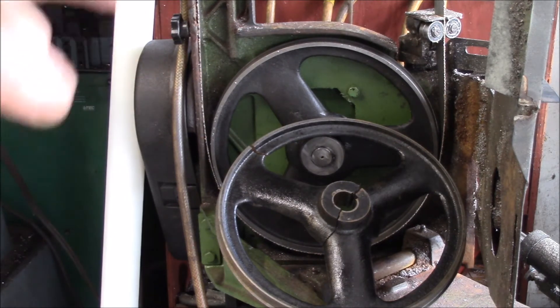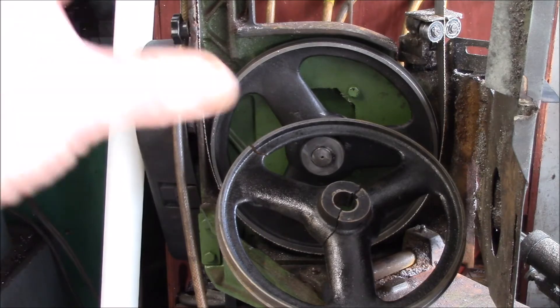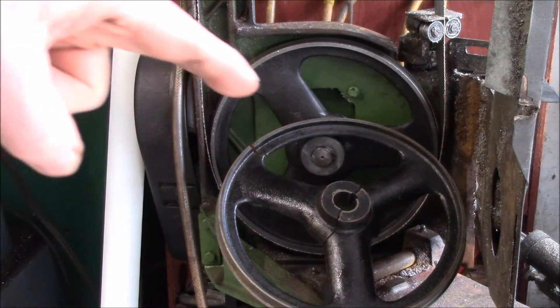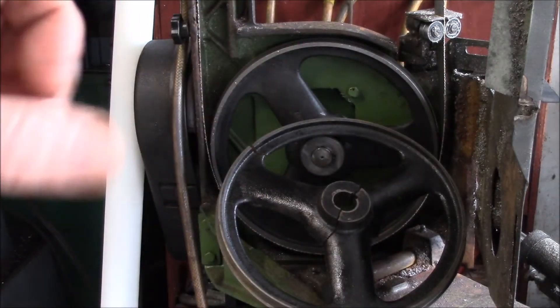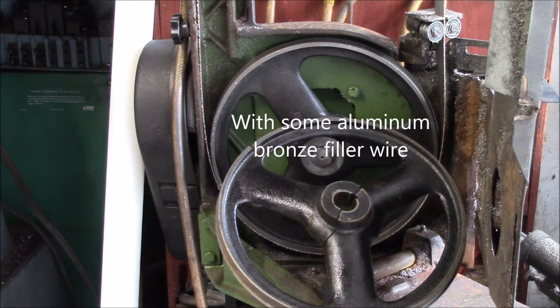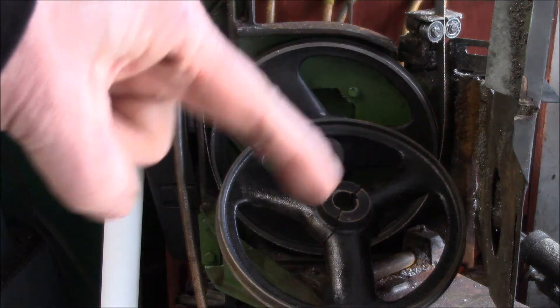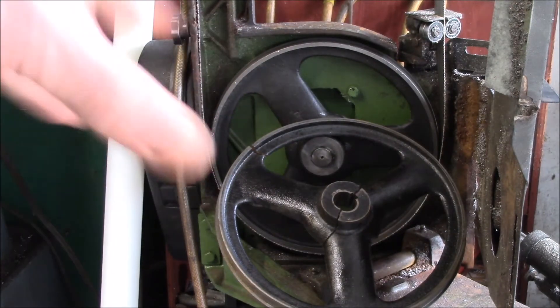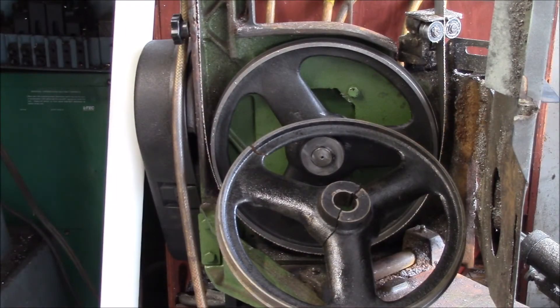I tossed around a couple ideas. One thought was to put it in a vise and squeeze it back together — there seemed to be a lot of stress in the part, the center hub maybe had tension because it blew outwards. I was thinking I could try welding the cast iron, but looking at it there seems to be a lot of porosity inside the hub. I put my endoscope camera down there and you can see pits all over inside.